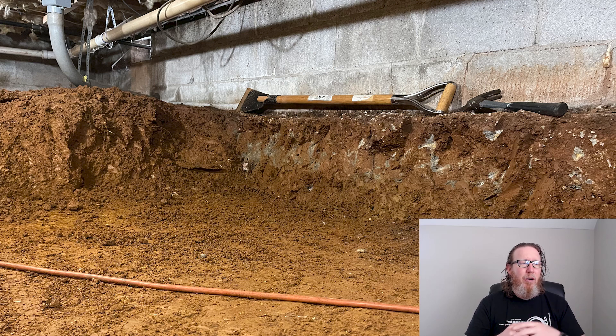In this scenario, I would certainly recommend that you consult with a local engineer or a home inspector that has an engineering background if you could. One of the solutions may be to backfill everything with three-quarter inch gravel, and possibly do some foundation supports with helical piles or piers. Call a foundation company and get their opinion. Or if you were planning on finishing this, you could fill it up with gravel and pour a slab, and then the slab would hold that footer.